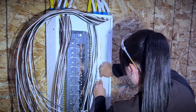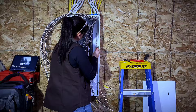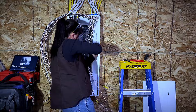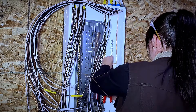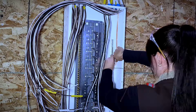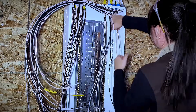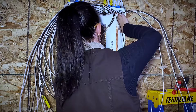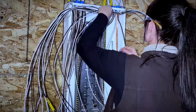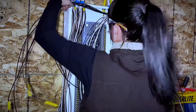Once all of the jackets are off and everything is labeled properly, it's time to land the bonds. If you want your panel to look a little bit neater, it is important to unravel those bond wires so that they go directly towards the back corner of the panel. People are constantly asking me how I manage to get the wires so straight inside my panels — it's really easy. All I do is run my hand down each wire before placing it, basically shaping the wire to naturally sit where I want it to. This little step is the reason that I don't need to use a ton of zip ties in my panel. Shaping your wires before placing them will force them to sit exactly where you want them to.